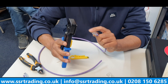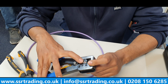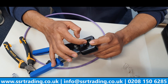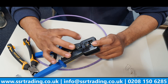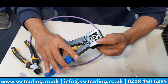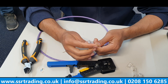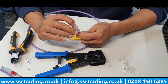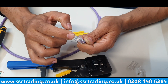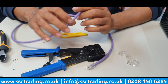Cut just a little bit so the cores go straight out, then press and send the plug out. Check to make sure all the cores are outside the blade area and not bent inside, because that's where the blade breaks. I can see all eight cores are out. Use the crimper, then once crimped make sure you pull it to confirm it's all solid. Recheck that the copper cores are all separate - no core should be touching an adjoining or neighboring core.